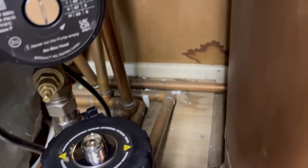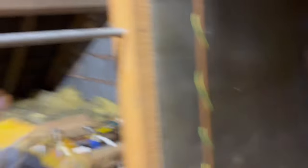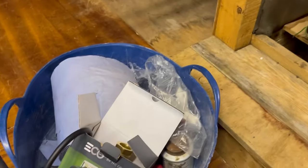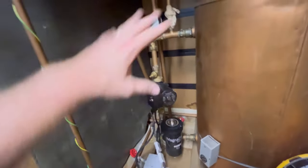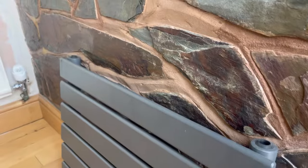I think we're going to be okay today - that might be my famous last words. I'm just going to quickly replace the diverter valve and I think I'm going to cut in a balancing valve on the hot water return. It's absolutely roasting up here, 100 degrees. I've got my fan - I'll just undo these three nuts, get that out, get the new one in. New diverter's in, I'll just put a balancing valve just down there so I can balance the hot water later. I just wanted to get out of here - it's screaming up here. Balancing valve and diverter done - get out of this loft!